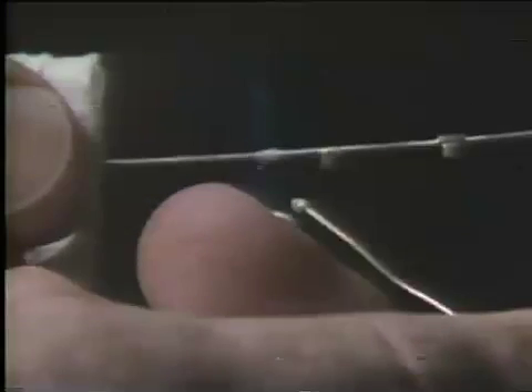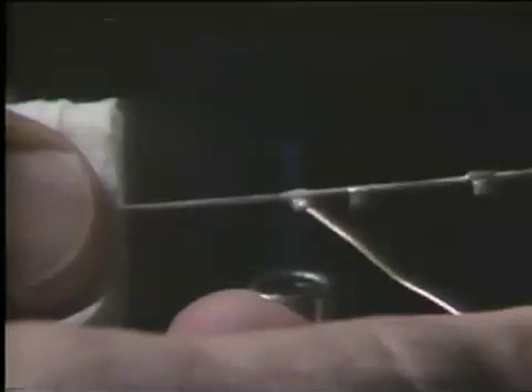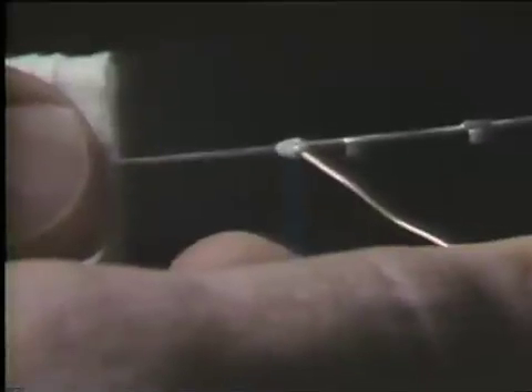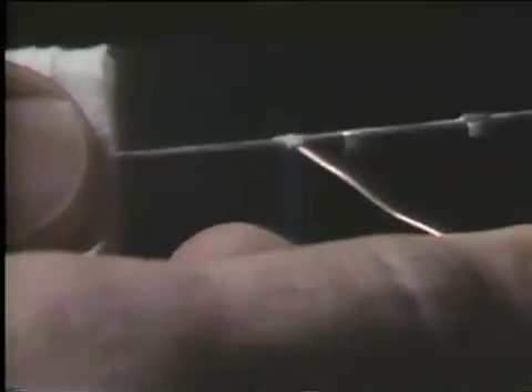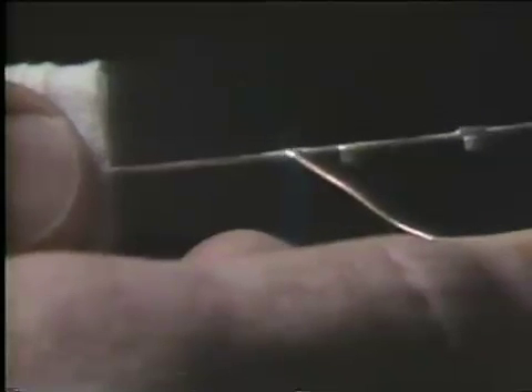Flux has been added onto the gold wire at the spot where we want the solder to flow. To make the solder joint, slightly cross the brass wire with the gold wire, and then pull it down into an angular relationship with the main wire. The solder joint should be smooth and continuous, free of pits and surface defects.